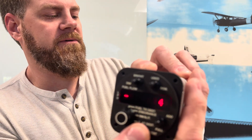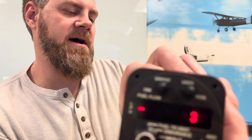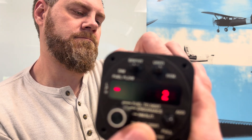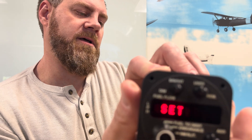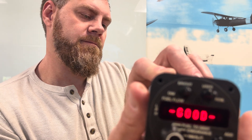Now that it matches the transducer, we can save it by pressing the Enter/Test button. It'll do a countdown from five — you'll see five, four, three — and once it says 'Set' you can let go. Then it'll say 'Good' and go back through the self-test window and back to the main screen. That's just to set K-factors. We're going to recycle power and go back through to check all the rest of the settings to make sure it's configured correctly.